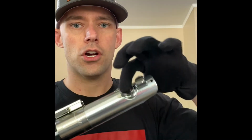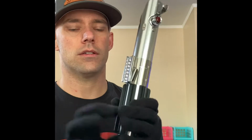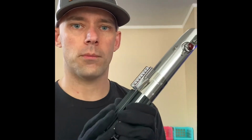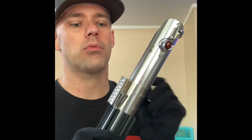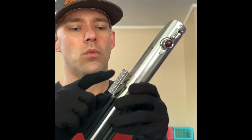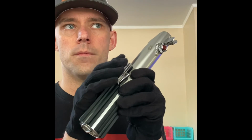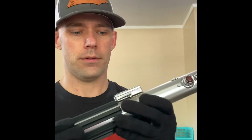These are not functional. The button here isn't functional, just the bubble strip is. It has a single switch operating system. It has a Proffieboard in it. So if you're familiar with Proffieboard, it's using the SA22C prop file. Whoever purchases it, I have the instructions on how to operate it, printed off, so they'll get those. But there's one tactile switch underneath the bubble strip here. And that's how you turn it on and off and operate the saber.